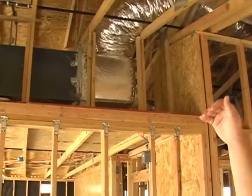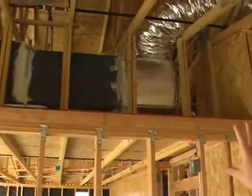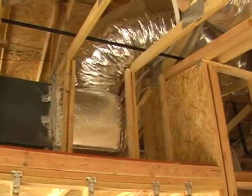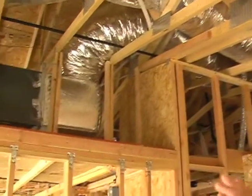At this point, air can flow right through the insulation and the insulation becomes nothing more than a filter, filtering the air right into the house. If you looked with an infrared camera up at this corner once it's drywalled, you're going to see a huge hot spot right there. It's going to show a big red spot in the middle of the summer because the air is just flowing right through your insulation.